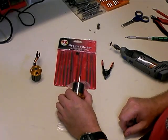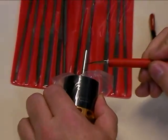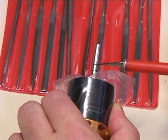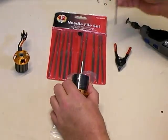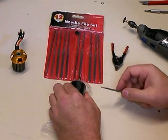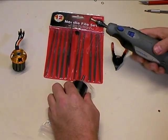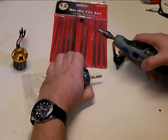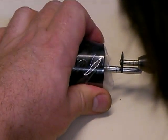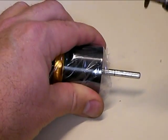Now that we've got the motor in the bag, we can go ahead and grind our flat. You can see that little nick right there that we put with the set screw. We're going to start from about a sixteenth of an inch below that until about a sixteenth of an inch above it to make sure we have plenty of flat on the shaft. There are a couple of ways you can do that — you can do it by hand with a needle file set and just file on the shaft, but the shafts are pretty hard and it's a very slow, tedious process — probably ten minutes of filing. Personally, I like using a Dremel tool because it's a lot faster and does the job quite well. I'm going to take the Dremel tool and basically just set it down on the shaft and go back and forth. As I cut the part I'm grinding out, it's going to get wider and wider. When it gets to the point where it's as wide as I want, then I can stop.